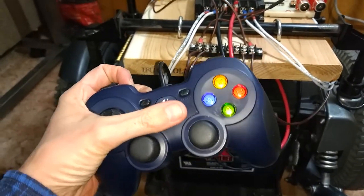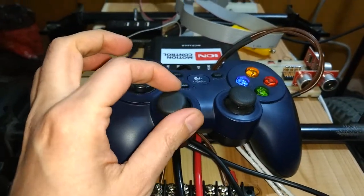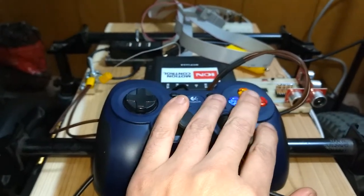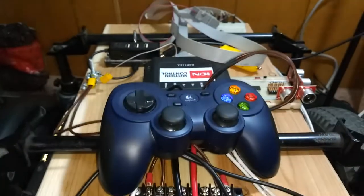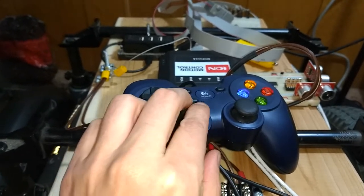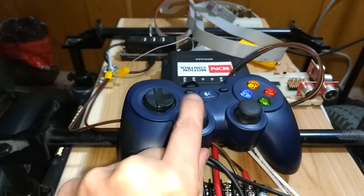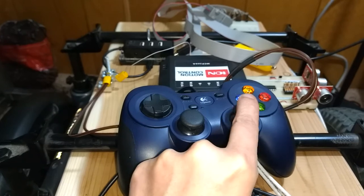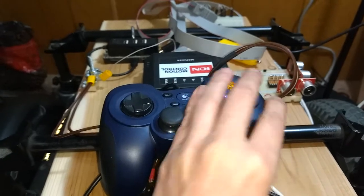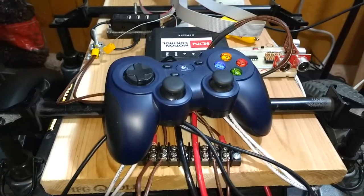I'm going to have one of the buttons be a mode switch so that only one joystick is being read at a time. So in case someone's hand goes over and touches something, it doesn't cause a malfunction of something else. It just won't send a signal while it's in a certain mode, except from one joystick. You've got to push a button, change it to another mode, and then the other joystick will be activated and this one will be deactivated. And this is so my fiancée, who's disabled, won't accidentally hit something and cause it to go haywire.